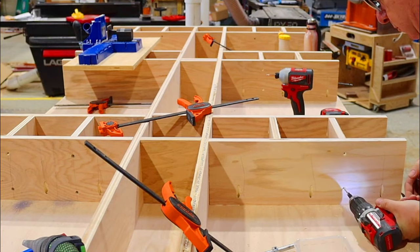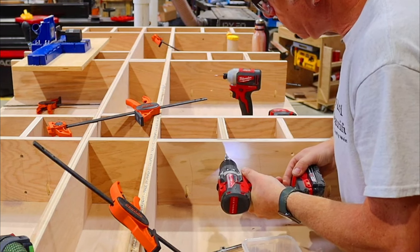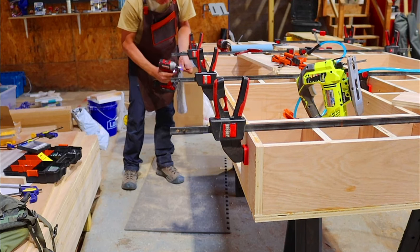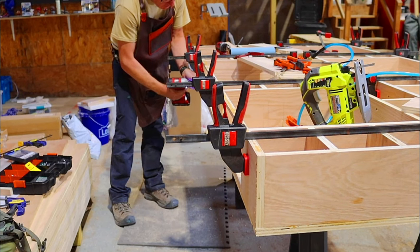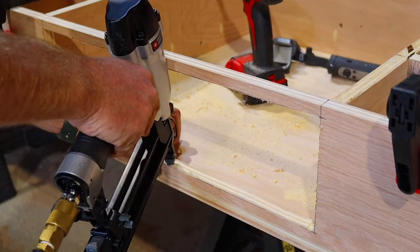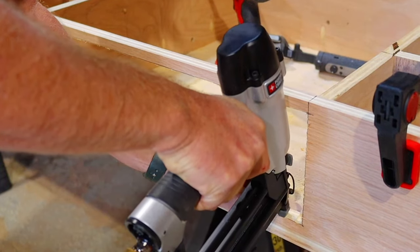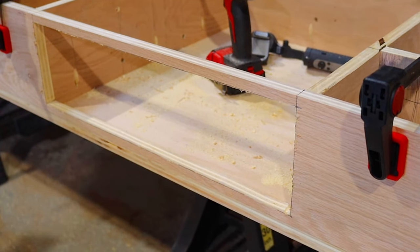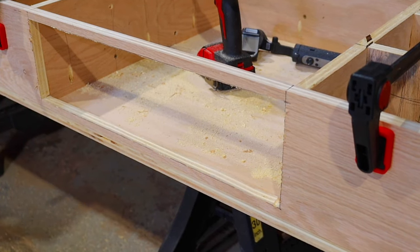That's the way it went for the better part of a few hours. This is definitely not a 30-minute and done process. There are a lot of pocket screws, a lot of deck screws, and a lot of glue to put down, and you want to make sure this thing is square. My suggestion is to find whatever music makes you dance, get in there, and just get it done. The drawer opening top and bottom pieces are only half-inch thick, so I grabbed some three-quarter-inch brad nails and made sure to tack everything down to give it extra support.